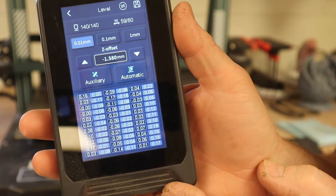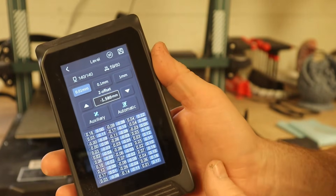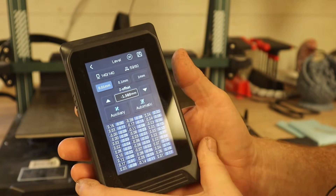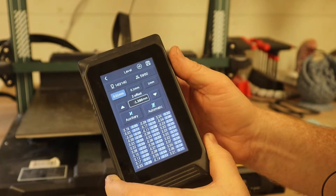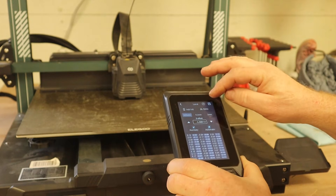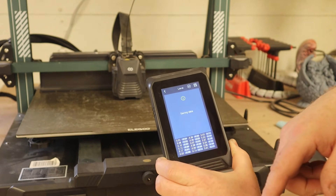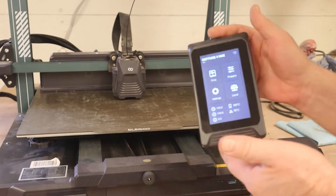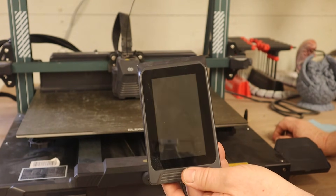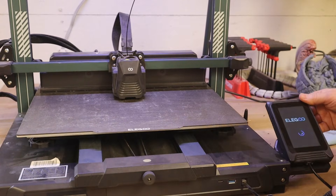This is about as close to zero as I've probably gotten — definitely the best leveling job I've gotten out of this printer. Once you've gotten to that stage, you'll see up top there's a little disk drive icon — for anyone younger than 35, it's a 3.5 inch floppy disk we used to save information on computers. It would hold all of like 20 photos. Click on that — save and restart to apply Z offset and leveling data. Confirm, let it save. The screen jumps back and everything is saved. Power the printer off, let it completely power down, then back on. Let it reboot and then we're ready to print.